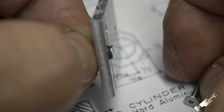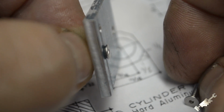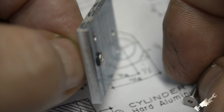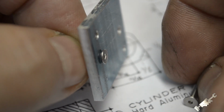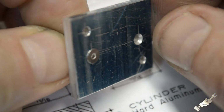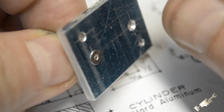I don't know, these countersinks need to go in about 30 thousandths deeper. So yeah, it's not the end of the world, but I just have to put this back in the mill and countersink a little bit deeper, or maybe just do it on the drill press. I don't know. I like to get it nice and straight so the countersink will stay concentric with the hole. So that's that. I'm going to do that, and